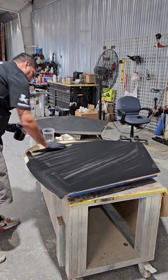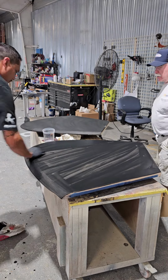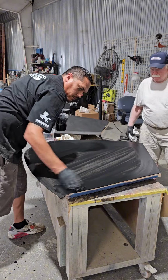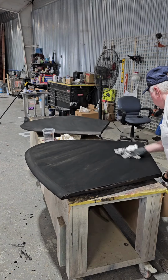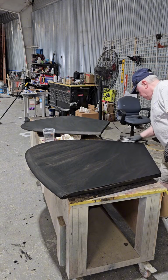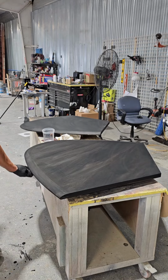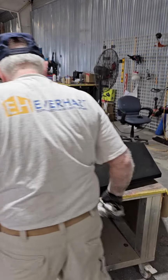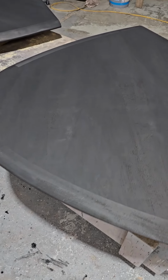I know y'all have seen me do a candy blue cabinet door if you've been following the channel long enough. I really like playing with our Renner dye stain colorants. These are the stains that are used for all of our spray stains. They're microlith pigments and they have fantastic coverage and, more important, clarity. So we're actually going to end up using a blue dye stain, and it is a really nice look on some of the figured woods. It gives it a lot of depth and just looks awesome.